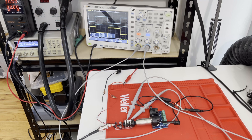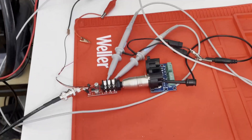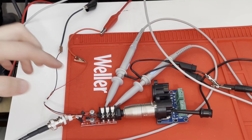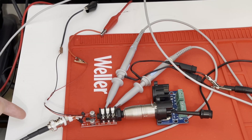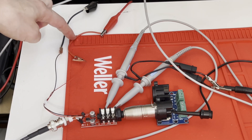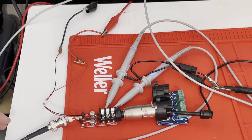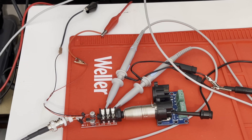I'm going to show how I've got this hooked up, which is just the standard way according to the hookup guide on the website. Zooming in on the board — this is the THAT1646 Outsmarts board. It takes plus and minus DC voltage; I've got it hooked up here with plus and minus from a normal DC lab bench top supply, and then the input from the signal generator, which I've rigged up with a janky coax and BNC connector.